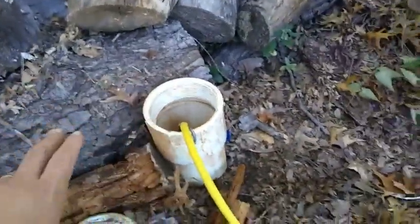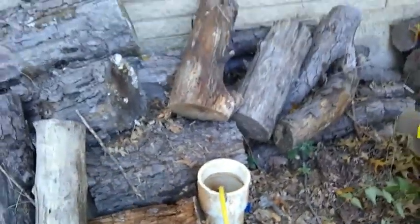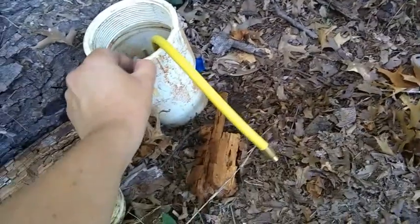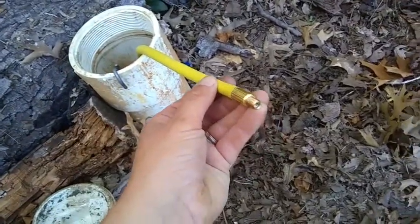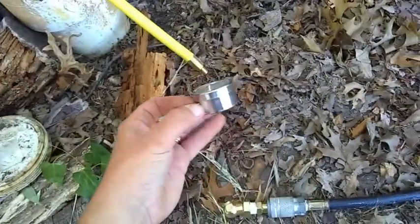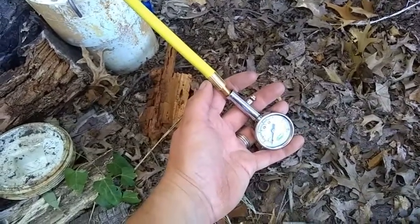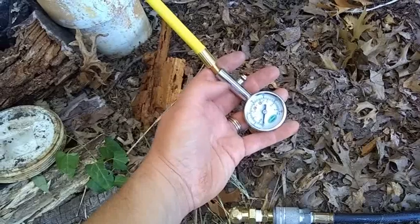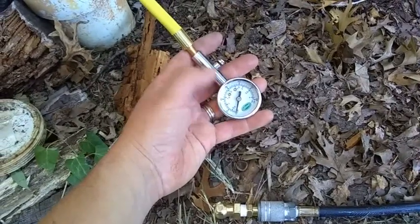When the test ball is inflated in the tube there's a cone shape that goes out at an angle — you're not supposed to be anywhere near that in case it slips off, explodes, or pops out. I have the chain connected so I don't lose it down the pipe, plus the extension so I can connect my air pressure gauge to it. While filling the sewer lines and testing the water level, I can monitor the air pressure and add a couple pounds if needed to maintain the seal.